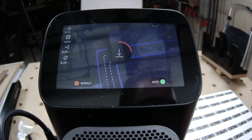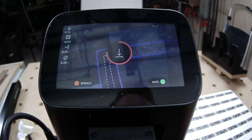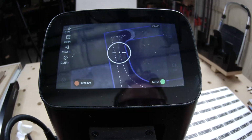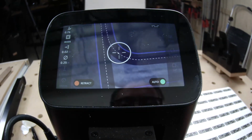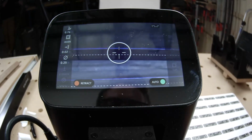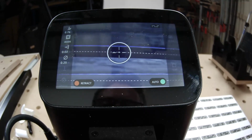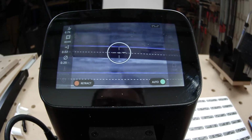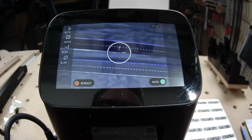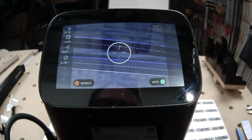With the offsets here, you can get a little more aggressive on the roughing passes if you're comfortable and confident. And so then when you come back on that finishing pass, you have just a little bit to clean up. You can clean that little bit left up at full depth and leave a nice clean surface. The less material you remove with Origin, obviously the easier it is to control. It's a hand tool at the end of the day.